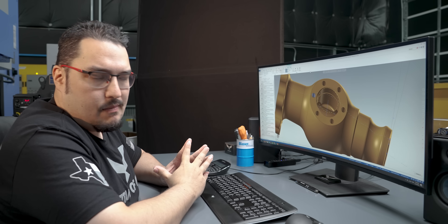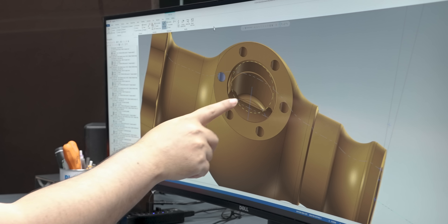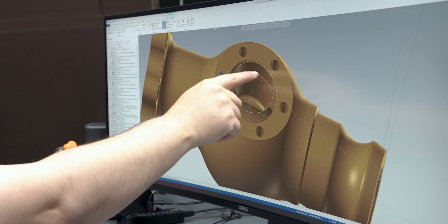The next tool that's coming up, we're going to be running an end mill to finish these two bores inside of the part. We just start right in the middle from our previously drilled hole, and then we do circular passes until we reach our size. For those roughing passes, I'm doing 30 thousandths step overs to bring it to size, and then it does one final finished pass taking off 10 thousandths of material. For that one, I keep the spindle speed the same, but I slow it down to 8 inches per minute.